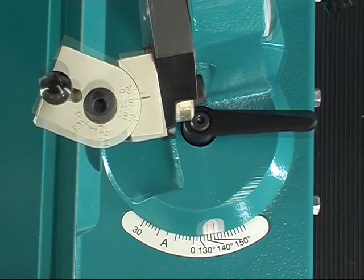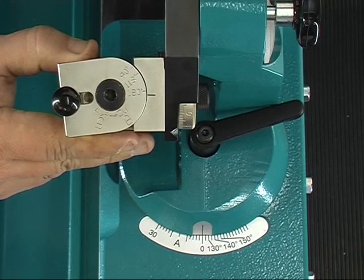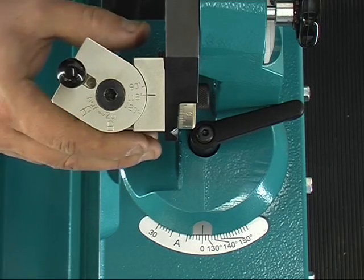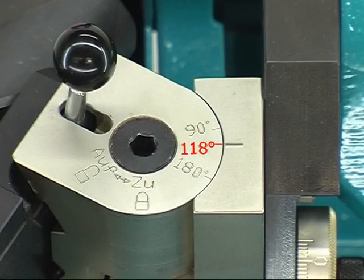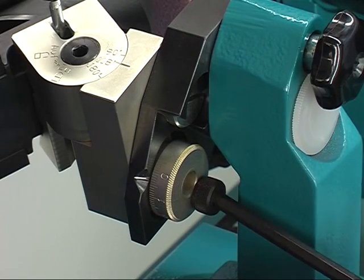The point angle of a spiral drill is usually between 118 and 130 degrees. It can be adjusted on the main scale or on the index stripe as requested. The clearance angle can be selected freely depending on the material to be drilled.